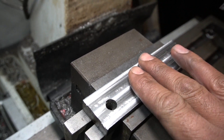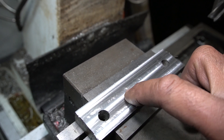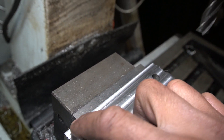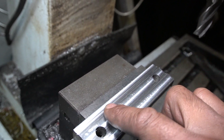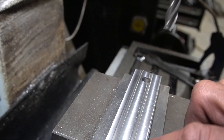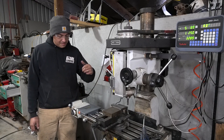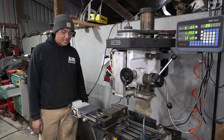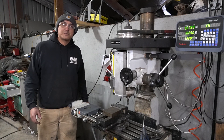Here's the finished product using an end mill. Looks pretty good, pretty smooth — just a little transition line between the cuts. This one is real smooth — that's half an end mill width at the recommended speed. Here's a full end mill width at the recommended speed, and here's a full end mill width at double the recommended speed. I'm pretty happy with that. That's a quick demonstration of what you can do with a combination of a power feed and a DRO — very precise with good surface finish. Post questions in the comments below, please like and subscribe, and we'll see you next time.